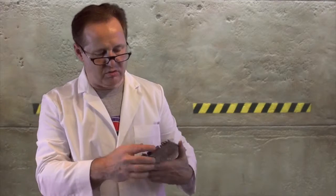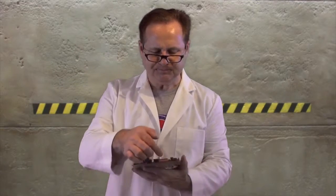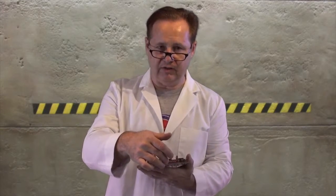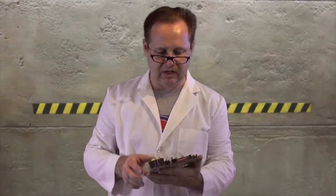This particular board also has dip switches on the side right here, and you need to configure these dip switches the way that your dip switches were configured previously. So before you remove it from the pack, you need to look at these dip switches and make sure you set it the same way.